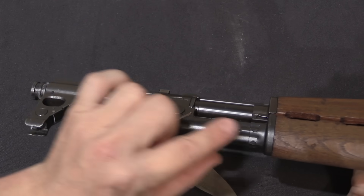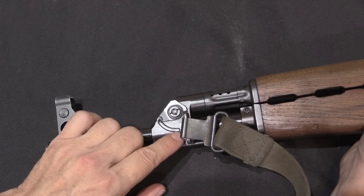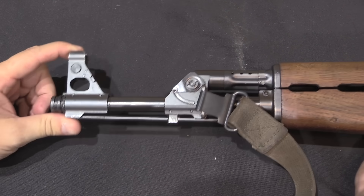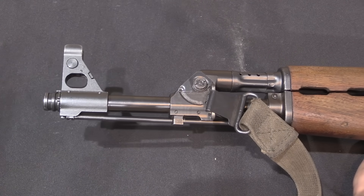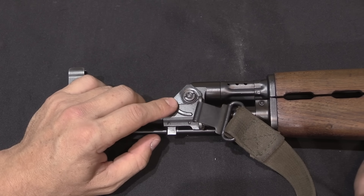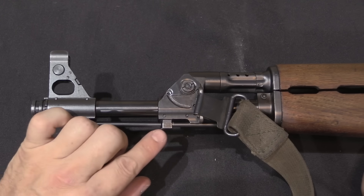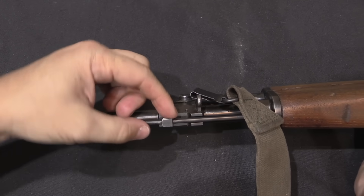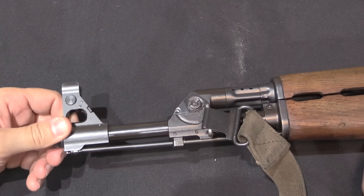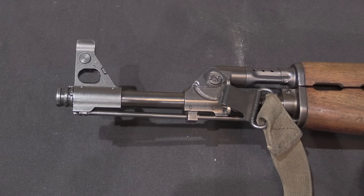At the front end of the rifle, there's a piece on each side that was originally a grenade launcher sight and gas cutoff combination. When pivoted all the way down, it cuts off the gas port so the rifle turns into a manual repeater — used for launching rifle grenades so you don't accelerate the bolt carrier back at a dangerous velocity. As part of civilian legalisation here that had to be removed, and the bayonet lug had its tabs ground off. But originally all M70s and M70As had grenade launcher sights, gas cutoffs, and bayonet lugs.